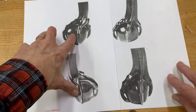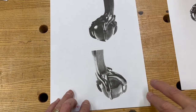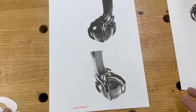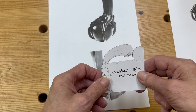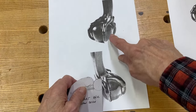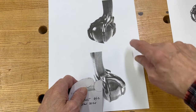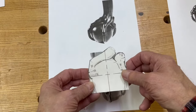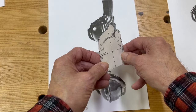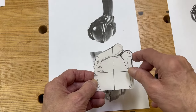So this is the one we're shooting for. I had used a template earlier to define it, but looking at this, this part goes up higher than the back. So I made another template — I think it looks more like this. We're going to use that to define the edge. Our next step is to lower everything above that by about a sixteenth of an inch.